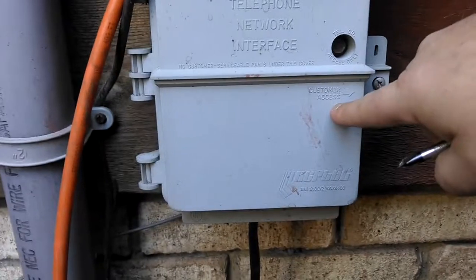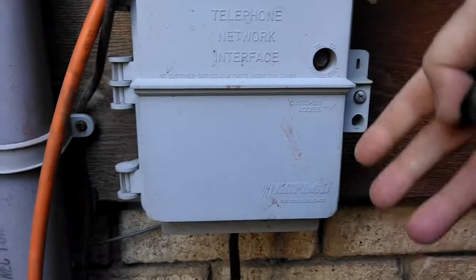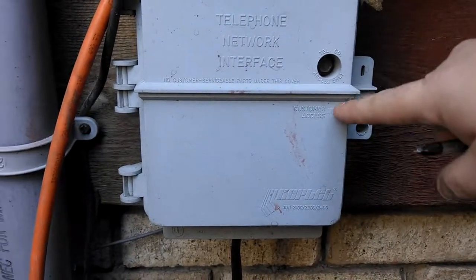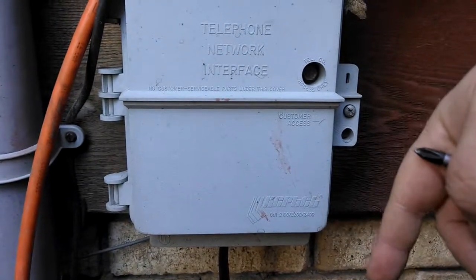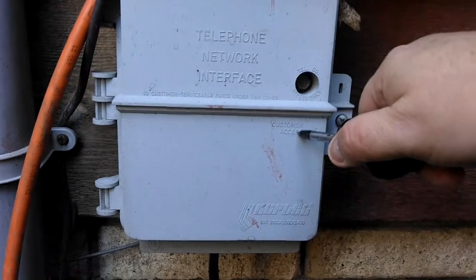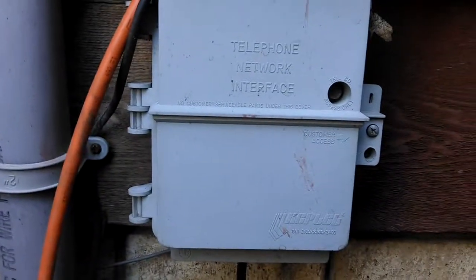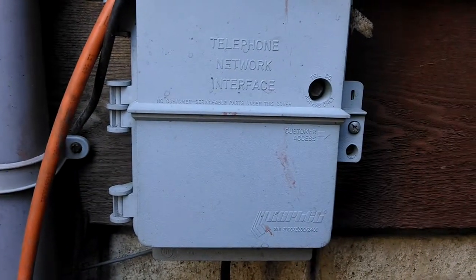If you still have the same issues, you call the phone company, and you can be assured they're not going to try to bill your ass off. Or, well, they're still going to try, but you can at least know for sure, following the troubleshooting steps that your telephone guy is going to do, that the problem does not exist inside of your house. The problem could be with your drop, the problem could be with your F2, the aerial lines, or it could be back at your CO.